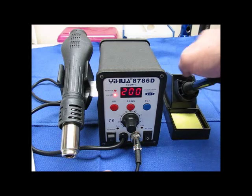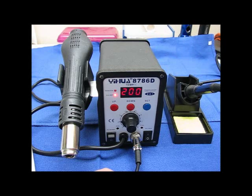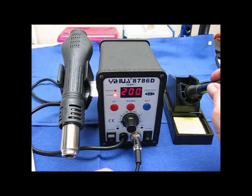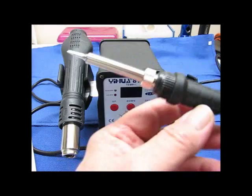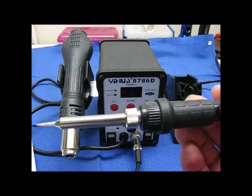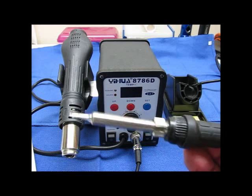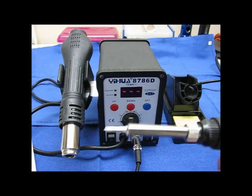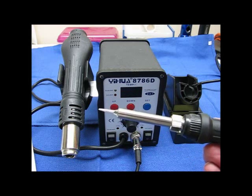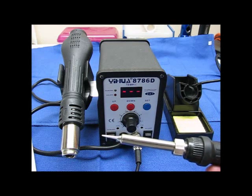The iron is hot. It may not be quite 200, but it's darn close. It's a fast-heat iron, that's for sure. The soldering iron is a 50-watt iron — it's more like a pencil tip. I'll probably like that for some of the small components, but not for big heavy stuff. It's a 26-volt soldering iron with 50-watt power consumption and a temperature range of 200 to 450 degrees.